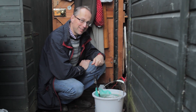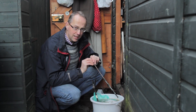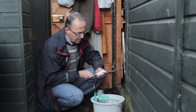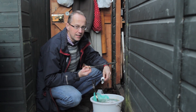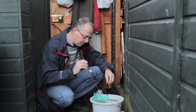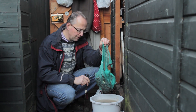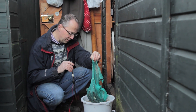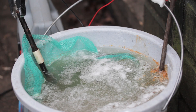Well this bucket approach is certainly working very well. Just been cleaning off the electrode periodically — look at that — that's the sacrificial electrode. All that muck on there, I keep grinding it off, but this is all the rust debris and what have you. It really really is doing the job. I think it's now so black I'll probably just run the grinder up and down to make a nice good contact. The components I've put into a bit of netting to try to do them in bulk underwater. And they certainly are de-rusting and the water is beginning to go a browner colour.